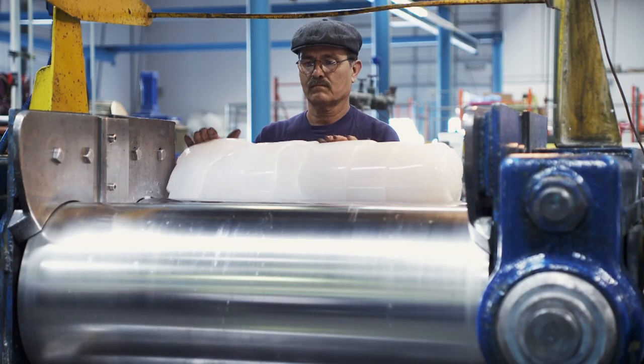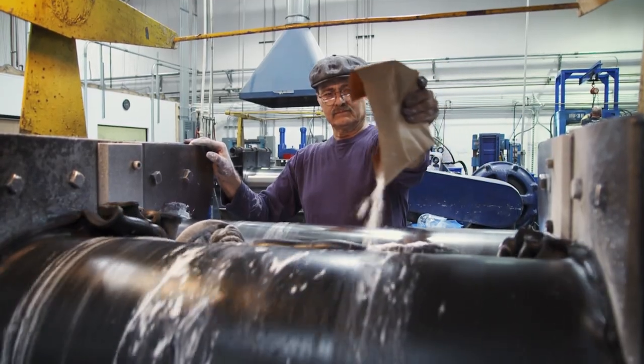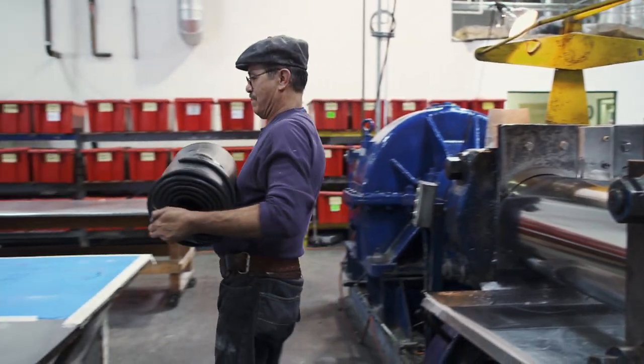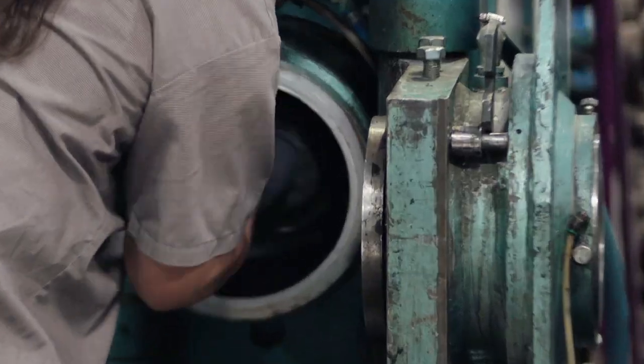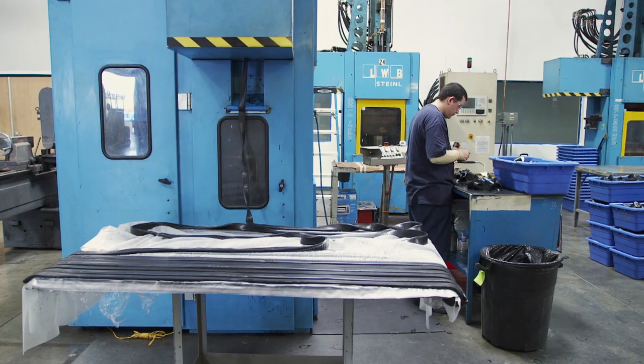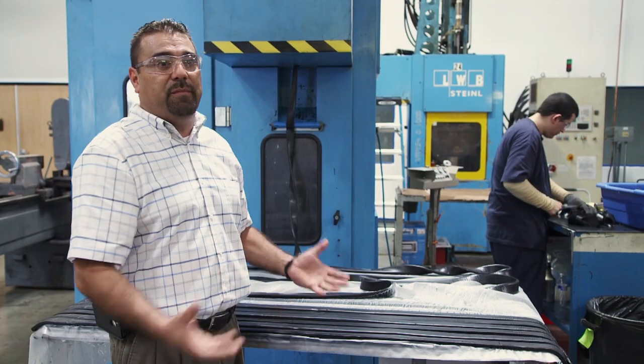The black band and the stand are made of rubber at a separate location. The synthetic rubber starts out clear. It's put through a set of rollers to mix in the black colour and an extender compound that helps keep the rubber pliable so it won't dry out and crack with age. Next, the rubber is sent to an extruder that will turn the giant Tootsie Roll into a long, fat black shoelace. The shoelace is injected into a mould machine which forms the band and the base. It injects the rubber through a gate and delivers to individual cavities, and then with pressure and heat, it cures them in eight minutes.